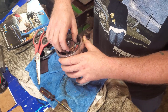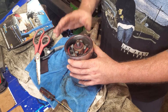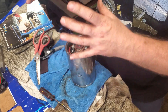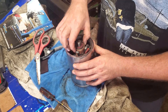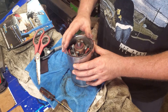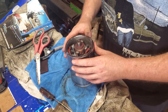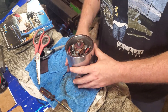Check your armature up here. On a good old worn motor that you've gotten lots and lots of use out of, it'll have a ridge up here, and that will make it difficult taking it apart. You won't be able to just slide it like you normally can. Keep an eye out for that because it will damage your brushes — and also damage your armature. You can repair it; you can actually turn it down in a lathe. You could maybe run it with a grinder — I'll show you how you kind of redneck-lathe it when we get this apart. I wouldn't really recommend that, but sometimes you've got to do what you've got to do and keep on cruising.